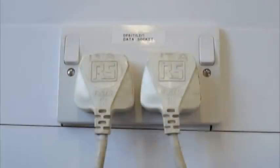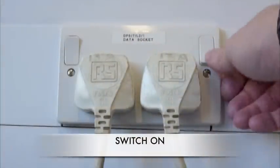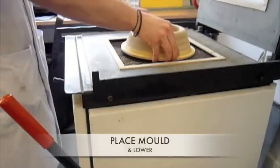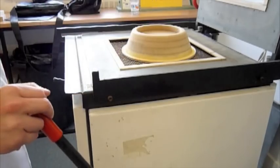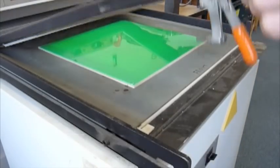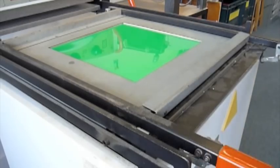You are now ready to vacuum form. Start by turning the machine on. You may have two switches, one for the heater and one for the vacuum. Next, place the mould onto the platen and lower the mould using the platen lift. Get your plastic sheet and clamp it tightly over the mould using the toggle clamps. Make sure it's held tight and there are no gaps around the edges for any air to escape.